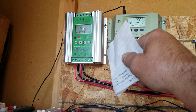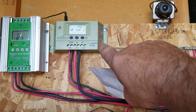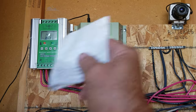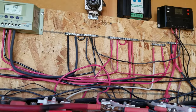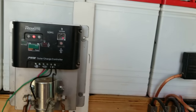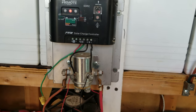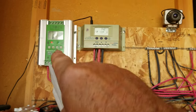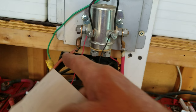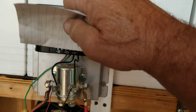Together I've got a thousand watts input feeding the batteries, and those are set and controlled. But for the PMA, you're going to need something to regulate the over-voltage. What's going to happen when you max out your batteries — those solar controllers will shut off and quit putting power into the batteries, but the wind turbine won't. It will keep on going. So you connect this dump load controller to the batteries — it's PWM, all one unit. You buy it as it is, and it's got settings inside. It doesn't have buttons you can change; it's already set up for a certain voltage. Once it reaches that, it will automatically click on.